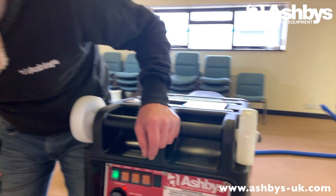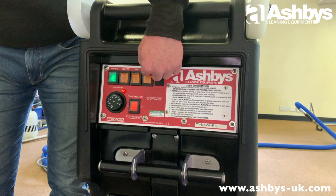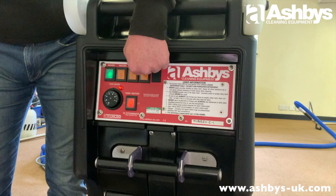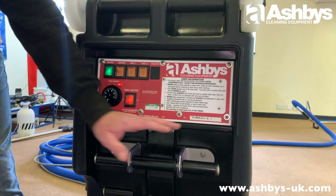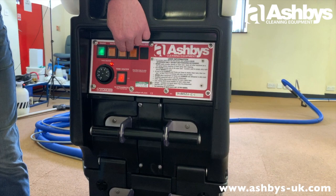On the switch panel you have vacuum motor two, vacuum motor one, and the water pump. When switching on an in-series machine like this, switch on vacuum motor two first, then number one. When switching off, switch number one off first, then number two — so if any motor were running alone, it would only ever be number two. The silencer hangs on the handle and its cuff connects to the exhaust to baffle the noise.